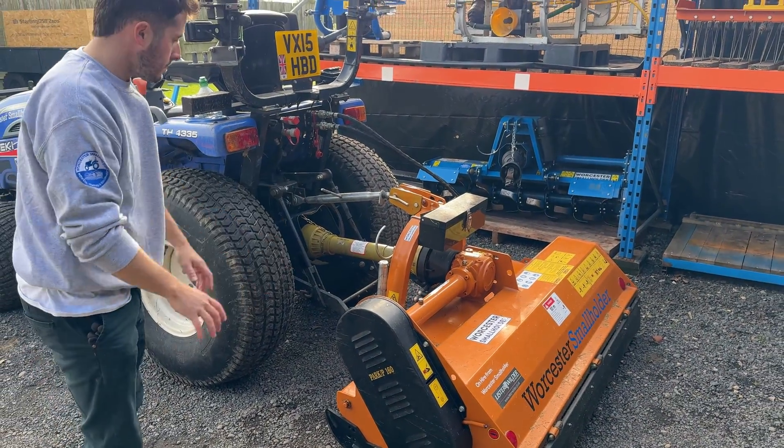Now I'm going to start the machine back up and lower it all the way to the ground, then turn the machine off. This is always fiddly — we've got quite a bit of ground clearance in order for the axle stand to stop on the ground and take the weight of the machine. I'm going to shorten the top link to lower the machine down. I'm going to crack this off, unwind the anti-wind bar, and slowly drop this down.